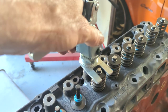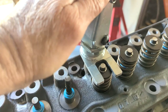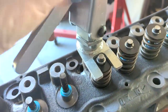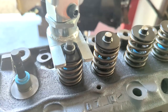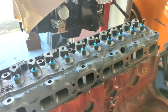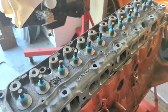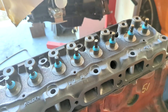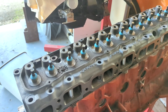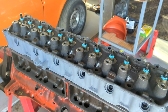This one I think is pretty close to being set up, so I've just got to get that collet to release. And there it goes - the collet's now popped up. Just need to pop that out, release it, take the spring off. All of our springs are off, and I've just run the verniers over all of them, and I've got clearance - probably about 40 thou clearance on all of them, based on the open position to total lift, which is about 507 to 508 thou max lift on the exhaust valve. So all looking good.